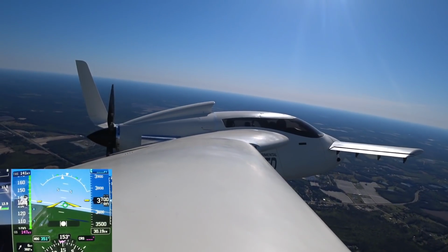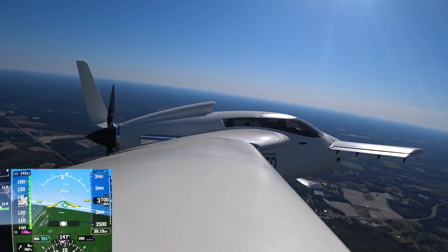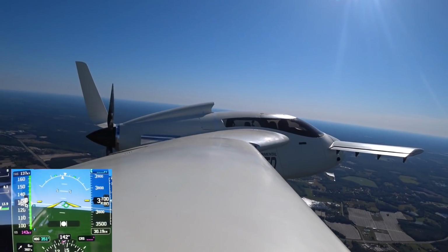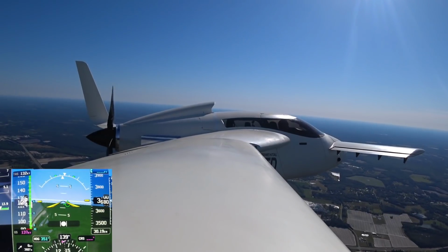And then on top of all that, because I got the new redrive belts on there, I'd set the tensioner up on those, but I think they kind of bedded in after this flight, and I actually had them jump just briefly. So at that point I was like, all right, I'm going to call the tower and get back on the ground.